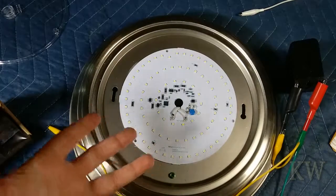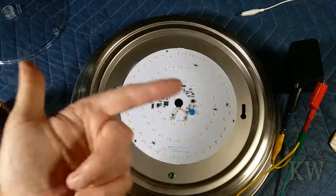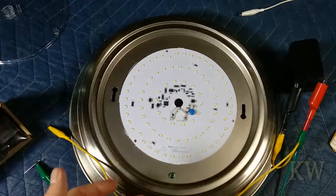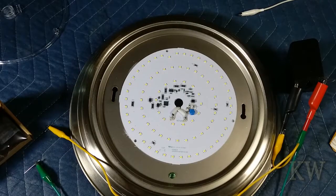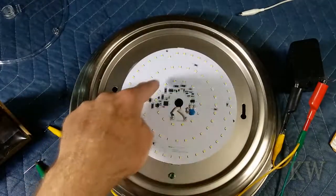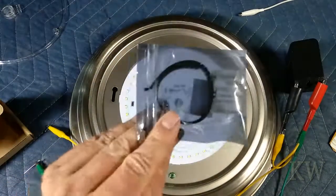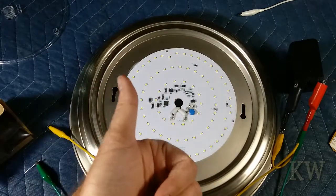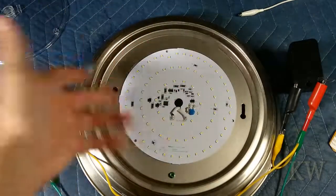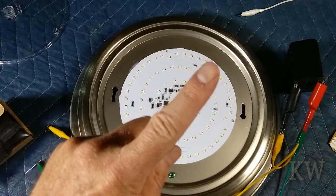Just a warning — you may not want to do this if you're not good at soldering or you don't trust working on electricity. Make sure it's not plugged in; take it off the ceiling and test it. You kind of saw my Jimmy-rigging here — you might want to do something a little more professional, but it's a quick and dirty way to test each LED to make sure it fires. If it doesn't turn on, we know that's the bad one. Next video, I'll show all the ones marked bad, desolder them, put new correct ones on, and give it a test. It's a shame to throw this out — it's such a nice light, and the only thing wrong with it is some five-cent LEDs. Let's swap them out. Until next time, have a great day!